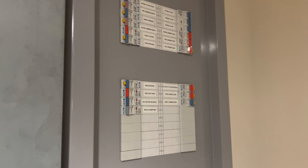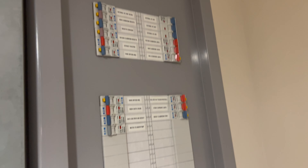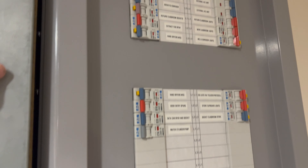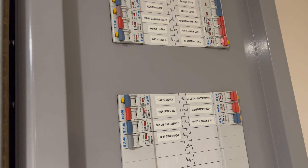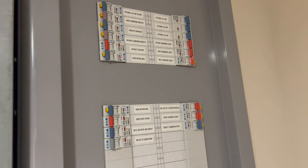Now we're on to the new bit — this was done about five years ago, so it'll be interesting to see what's going on. I've taken the lid off and most of it is all RCD-protected. There are a couple you'd like to see with RCD because the light switches are going below — well, they might not be under 50mm. Let's have a look — it's a nice neat board with the meter on there as well.